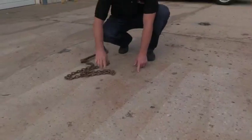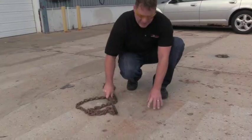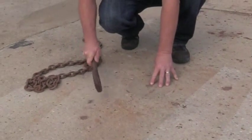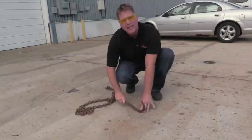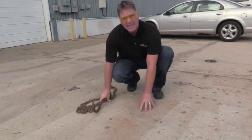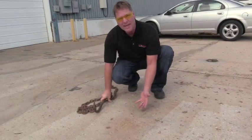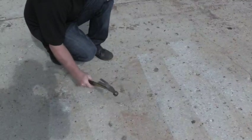So here we found an area that is making a little different sound. This is an area we'd want to investigate. I can feel a vibration here. This could indicate that it's a patch that has lost its bond or that it's not making contact with the sub base. So we found a spot — now we tap.